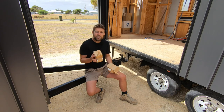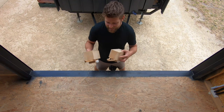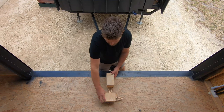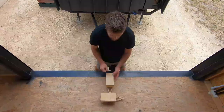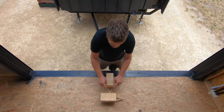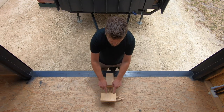The idea I came up with was to join the tow bar of one trailer onto the side of the other trailer, and that gave me a datum point to allow the rest of my join to work. The first reference our datum point gave us was the ability to set up the trailers at exactly the same distance every time. All I need to do is set up my main trailer, drive my side trailer in, hook the main trailer onto the side, and move the side trailer back or forth until the two trailers are square. Because the distance between the front of this trailer and where the tow bar hooks onto the side trailer is a set distance, these two distances where the wall continues into the side trailer will be exactly the same every time — meaning I can have swinging walls that come out from the front of the main trailer and nest into the side trailer.